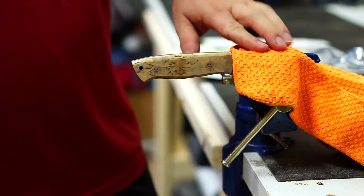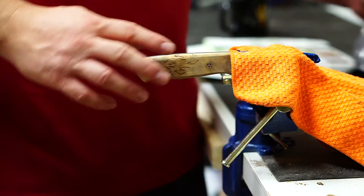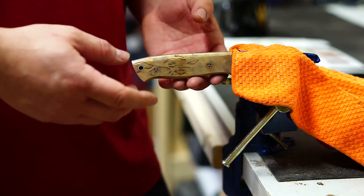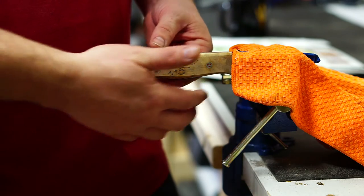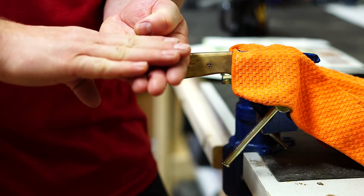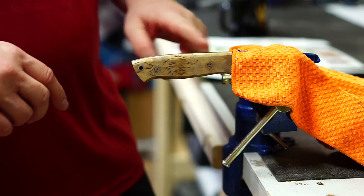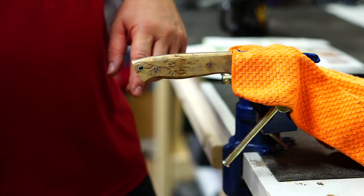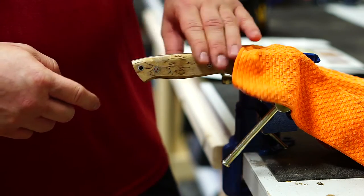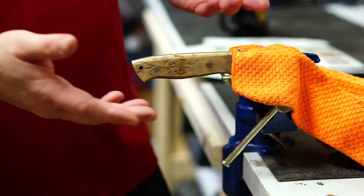I've added a rag loop under the blade in the vise for extra padding while I do contour sanding. I used a flat belt sander for the spine and pommel, and a spindle rig on my drill press to contour the base — basically to shave off the overflow wood, since the handle scales overset slightly to give wiggle room. That also helped grind off excess glue. Now I'm going to contour the hard ridge lines at the top and near the base, then sand the wood smooth and get it ready for light oiling.